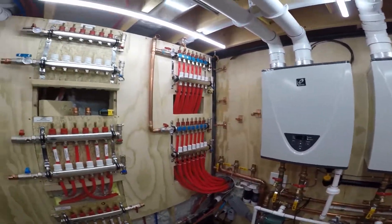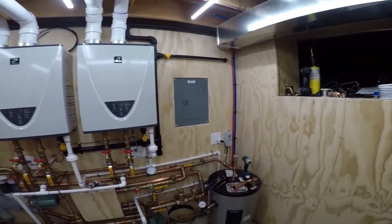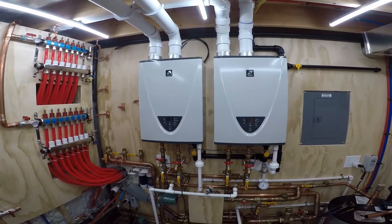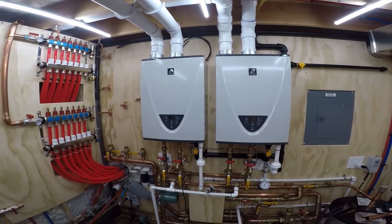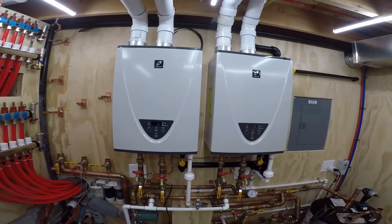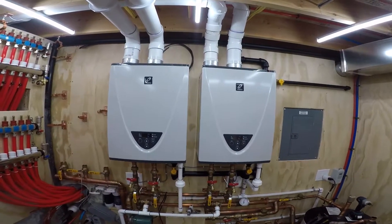Alright, down here working on the return plumbing today. Tank is at 126 and it's about to kick on. I made an altitude adjustment — I read online that flipping a dip switch to the next higher altitude has no reduction in output and it increases the fan speed by six percent, and a lot of people online said that solved a lot of noise issues for them.